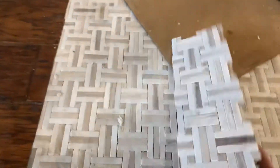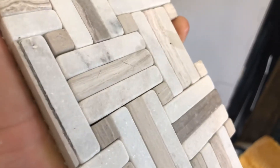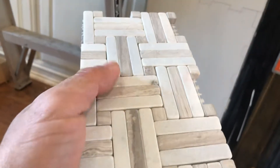Because I wanted this surface to be flush with the other surface, I had to spread the slab and then back-butter the material before sticking it. The homeowner says this is travertine and marble, but looking at the white shimmer and glisten, I believe those are quartz crystals — I think it might actually be sandstone. Travertine typically has more of a khaki and tan tone, while this has pinks and veins, but I could be wrong.